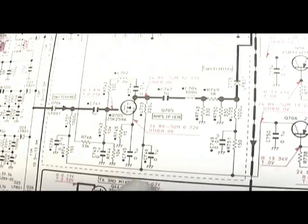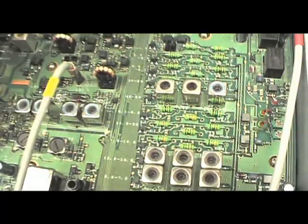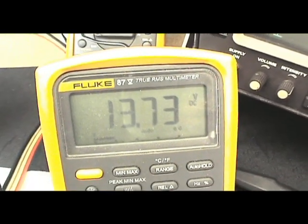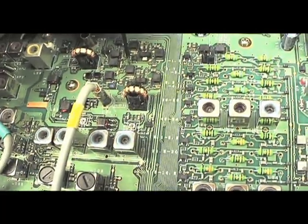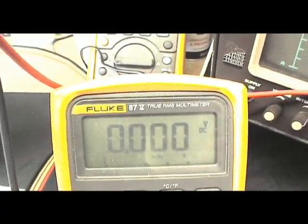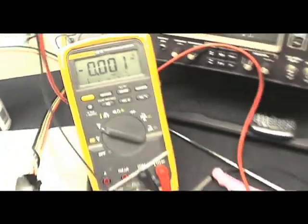Now we put a meter here to measure the voltage. That's with the preamp on. We have a look at this side here — that's L703. Just locked in here. L703, preamp on. Look on the meter, that's giving us 13.8 volts. And if we turn the preamp off, see that it's backed off again. On the meter, that's giving us nothing at all. So it's definitely switching now and it's working.